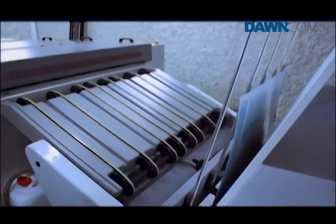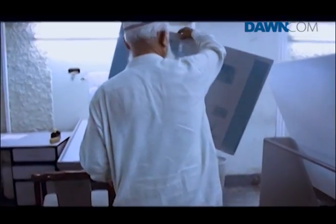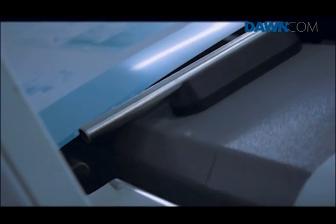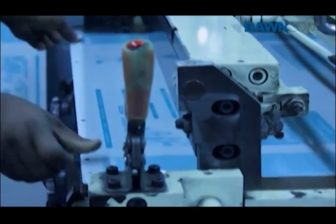The plate, a plastic-coated sheet of aluminium, goes into a machine that prints all the content to be inserted in the printing machine. The machine's laser beams scan the plate, hardening the plastic coating wherever there will be text or pictures. The blank areas that don't harden are then washed away in a series of chemical baths.